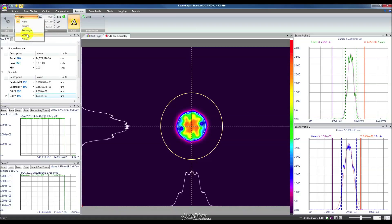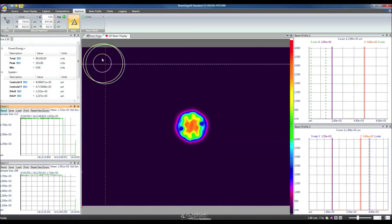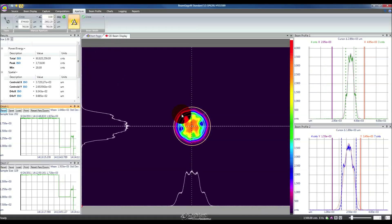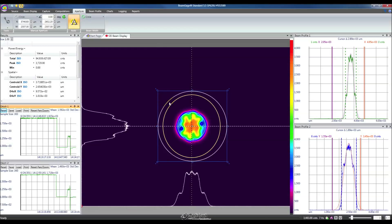We're going to use the auto aperture to actually restrict the data being used, and we can see that our beam width aperture is displaying a much more realistic beam width. We can also use a manual aperture to restrict it even further. The auto aperture is really good for beams, especially if they have a shift or are wandering — it'll move with the beam. In some cases, it does work best to use both apertures. We want to use that manual aperture about two times the current width of the beam.